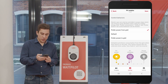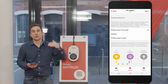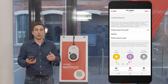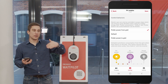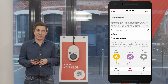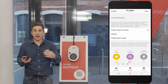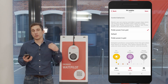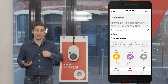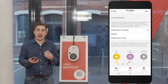On the other hand, switching to 'prefer power from grid' makes the Wattpilot jump to the next current stage earlier. For example, if the inverter is delivering an extra 20 watts beyond the current step threshold, the Wattpilot will instantly jump to the next current level — say, 7 amps — and will draw the remaining difference from the public grid. This is useful if you want your EV charged more quickly, with control behavior similar to high-power charging.